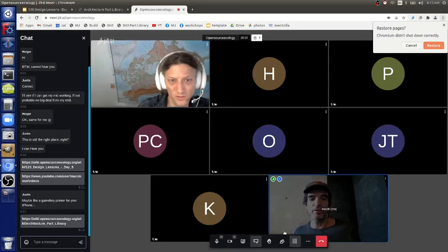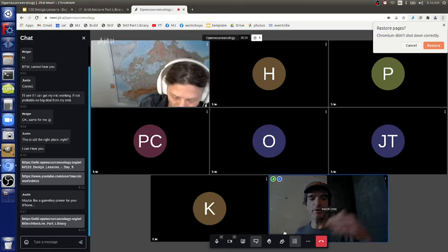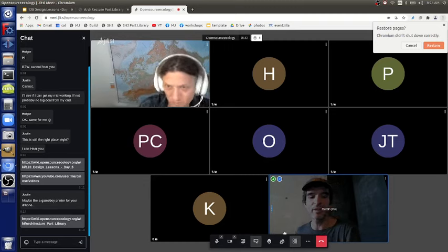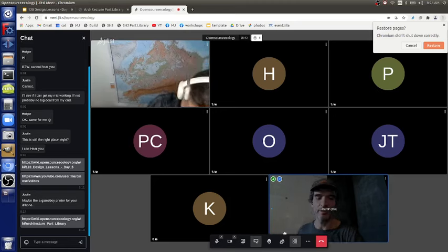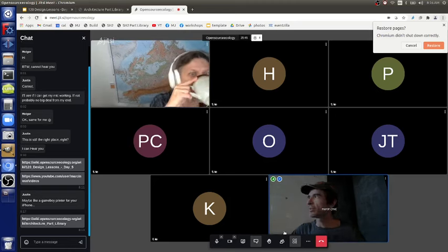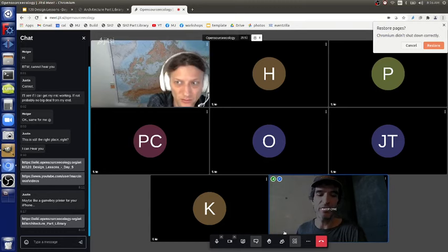We define front, back, left, right, and we can say, hey people, we'll divide the tasks. Let's say a group of people takes the front wall, the back wall, the side walls, and so forth. Then you can start getting oriented around the plane you have to work in. If you're building the front wall in front of you, the most convenient would be the XZ coordinate. If you define the bottom left-hand corner of you looking at the house as the 0, 0, 0 point, then the side walls would be the YZ plane, right? The back wall would also be XZ, just like the front.